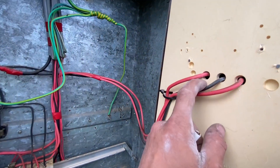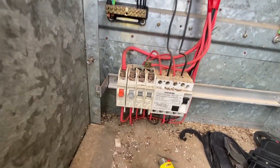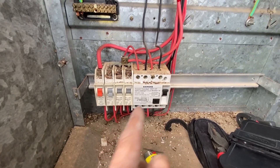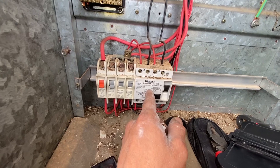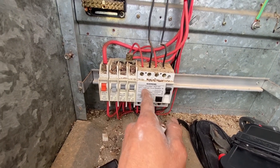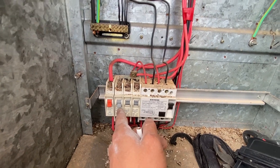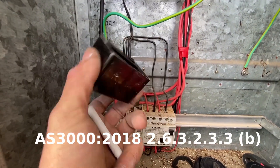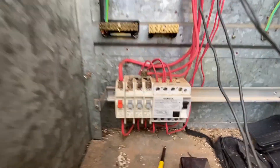Have a look at this old beauty — it's pretty neat, whoever done this one originally. We've got six mil for the metering yet they've got 16 mil coming in here. I'm going to change the circuit around because as you can see it's only got the two power going through the ELCB — this is how old this one is, she's still quite functional. Since I've played around with the lighting I have to modify the circuit, so that's why I'm adding this bad boy and I'll show you how I change it.